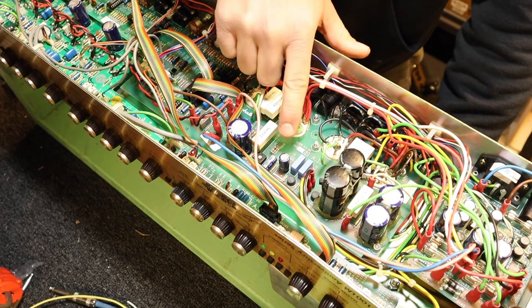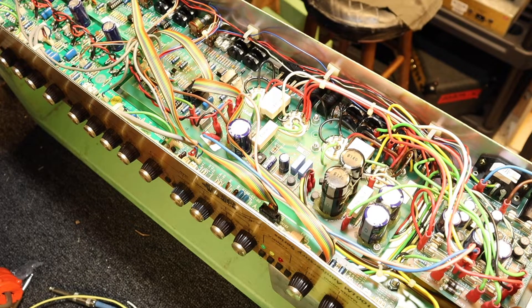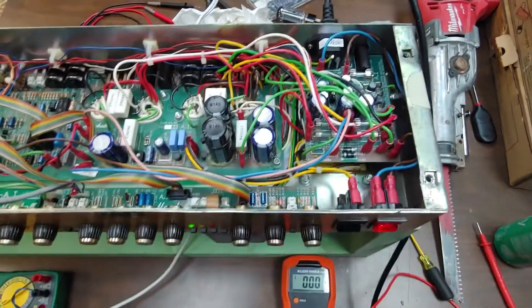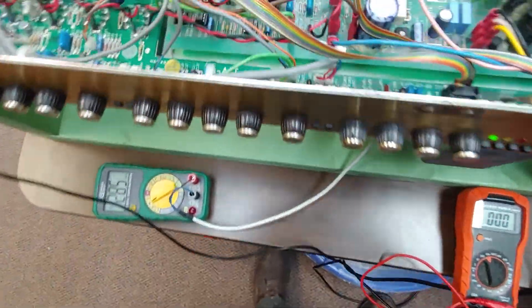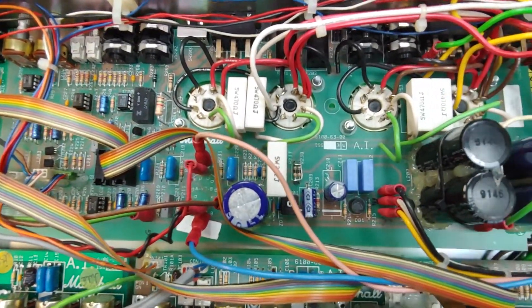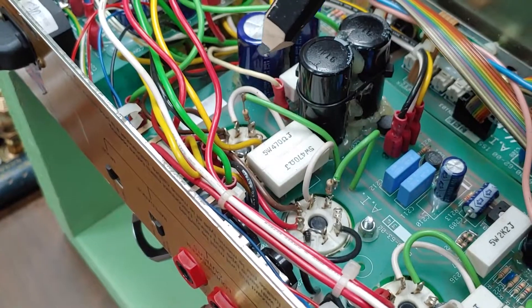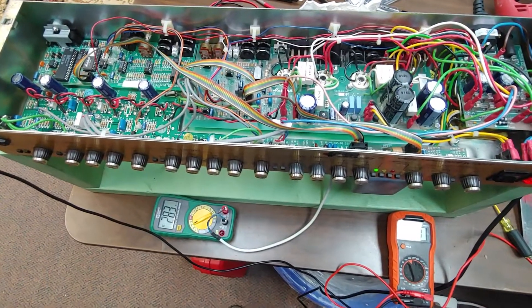These did read okay, but I don't know if they've been compromised because they've been burned. We've replaced this fuse, and I believe it blew due to an improperly inserted tube because the tubes are back in and everything's working fine. Those two resistors we talked about — they looked charred, so we went ahead and just bypassed those altogether. I have placed the replacement resistor right on the socket itself. So now we can proceed with biasing.